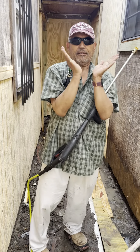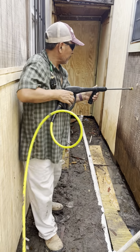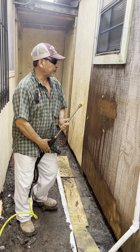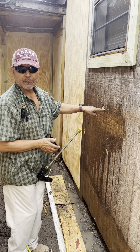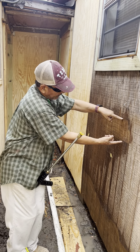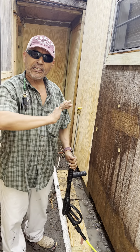One more thing — the spray comes out like this; that's the way the spray comes from the gun. For example, you put 50% of the spray in the middle of the previous line — not at the end of the spray. Don't do that because then you'll go off course. Just spray clean like this, and then overlap in the middle of the finish. That way, you're going to be clean and complete.